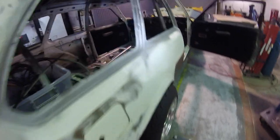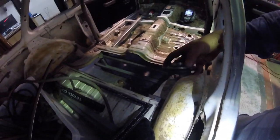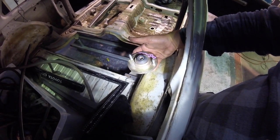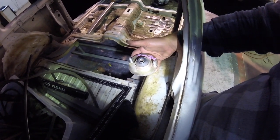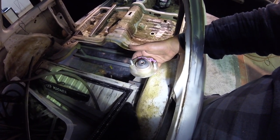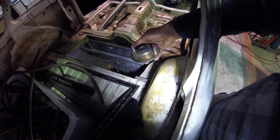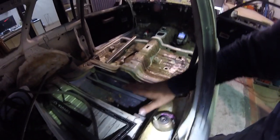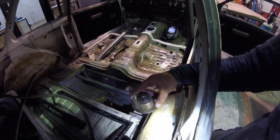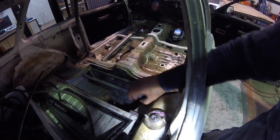And then in here will be, this is the top of the S13 coilover. So we have to build a strut tower that sits about there-ish. I've sort of worked it out, it's roughly 400 mil off the floor that's there. And then we just got to get that angle right. You don't want them straight up and down, you want them on a bit of an angle, because as the diff moves, it doesn't actually move up and down like that. One wheel will sort of go in a bit of an arc. So yeah, we'll set that off there, and then once that's there, the roll cage then gets built to this top section here, so your arms will go up there.